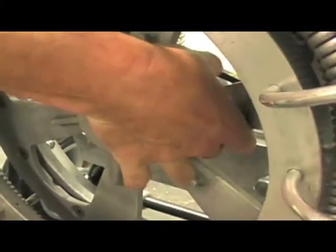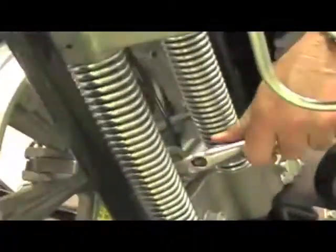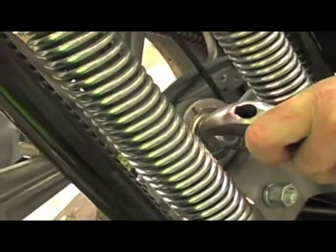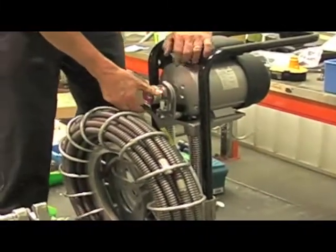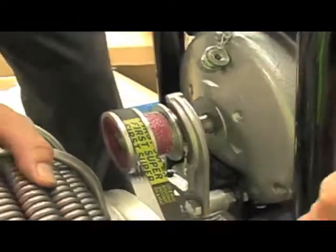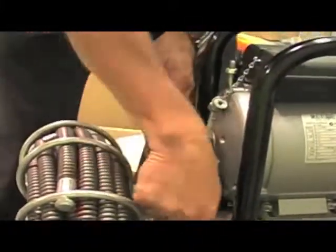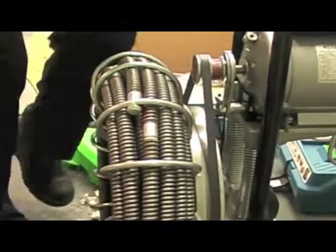Now this is where I'm going to lock that locking pin in. Then you grab your 19mm spanner at the back — I'm using a shifter in this situation, and a 19mm three quarter — and then you do it up. Now you can see it only moves that bit — it's locked in one of those holes with the pin, or those three little holes I showed you before. Now that's locked in, it's not going anywhere. You can put your belt back on, same thing again — watch your fingers, feed it over there, slowly move around. If the belt was sitting back further here, you can adjust that allen key there and bring that pulley forward so the belt runs in the central position, or right up to the shoulder, and that way it's got less chance of jumping off.